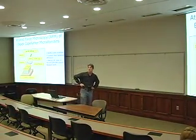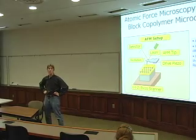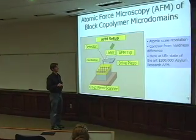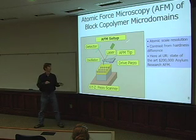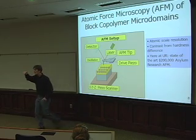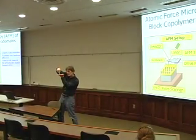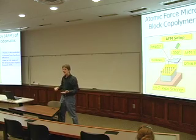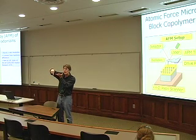Let me tell you a little bit about how this microscope actually works. This is what we actually have up in my physics lab on the 2nd floor here at Gottwald. It's a neat microscope. The way it works is there is a really sharp tip, which is basically a single crystal of silicon. Actually, the entire top part here is carved out of a single crystal of silicon, and it's oriented so that the sharp point of the crystal is aimed right down at the sample. And so the way this microscope works, believe it or not, is by physically approaching the surface and finding where the surface is, and then physically scanning back and forth and feeling what's underneath it. And again, think about the engineering that's required to do that, to actually position something to within a nanometer or two, and then raster it back and forth.